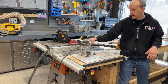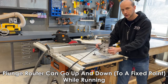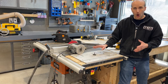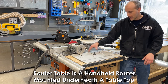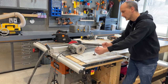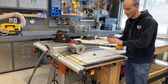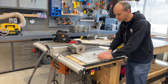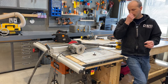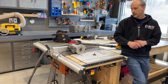This is a handheld router. There's also a plunge option where it sits in a case that goes up and down, so you can push it down and pull it up — that would be the plunge router, which is the most basic level to get. A router table is essentially a handheld router mounted underneath a panel with a flat surface for more control. Instead of holding the router and moving it around your board, the router table stays level and you run the wood along the spinning bit. At bare minimum, get a handheld router for basic edging and shaping to give your boards a more professional look.